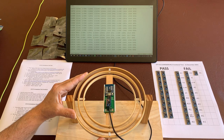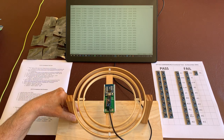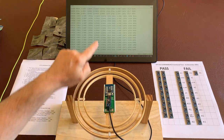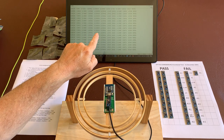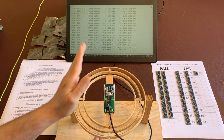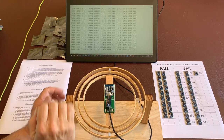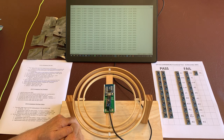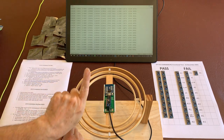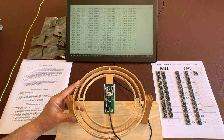In order to do the test we must turn the board in the gimbal through 12 cardinal points. The reason for that is that it measures both the magnetic and gravitational field in this area. To make the test a bit simpler, we're pointing the unit due north, or at least magnetic north. The magnetic field in this area actually points in that direction but it comes out of the ground at a rather steep angle — 78 degrees. The gravitational vector of course points straight down to the center of the Earth, so we need to measure this vector and this vector, and to do that we need to point the sensor in 12 different directions.